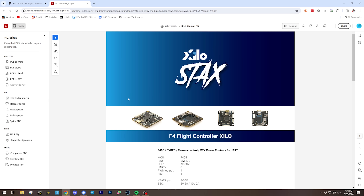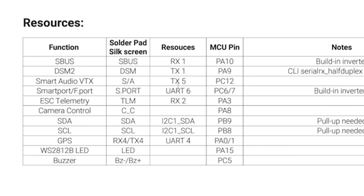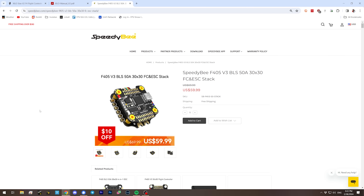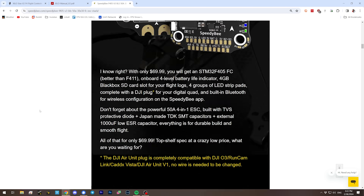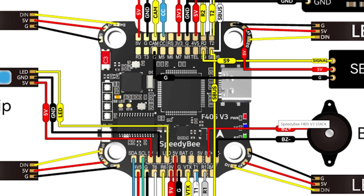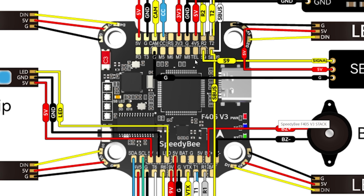But it's not just those. If we go to the user manual for this flight controller, we can see it actually has a full complement of UARTs: SBUS and DSM-2 on UART 1, Smart Audio on UART 5, and F-Port and Smart Port on UART 6. So there's a full complement of UARTs here, but they're not broken out on the board. On the other hand, looking at the Speedybee F405 flight controller — also an F4 — if we scroll down to the wiring diagram, we can see UART 2, UART 3, UART 1, UART 6, with TX and RX pads just like any other flight controller, but there are also some oddball pads like a telemetry pad and an SBUS pad.